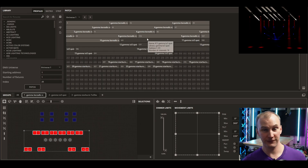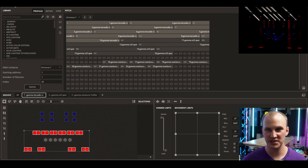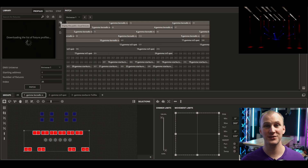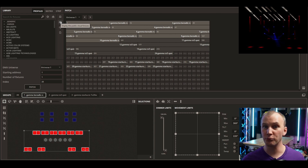We are all plugged up here and have our virtual lighting rig. Some of the things I really like about this software: you can get into the settings and there are a number of things you can turn on or off that can be really helpful. One of those is the ability to automatically load your last show any time you launch the program, which I definitely recommend — that's in the settings menu. The interface is pretty simple. When you first launch MyDMX, you have a patch window called Setup, and in here you can find your lighting fixtures and add them in. If your fixtures are not in the built-in library and you're on the internet, you can get to their cloud profiles available through the Nicolaudie cloud.